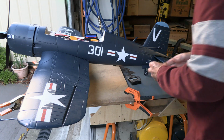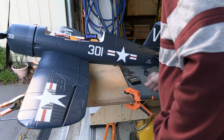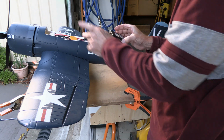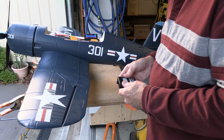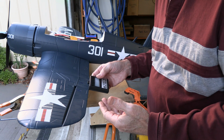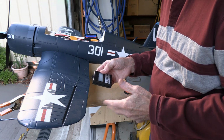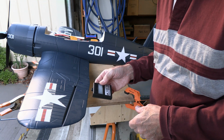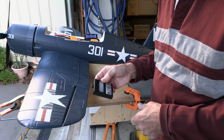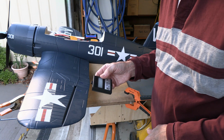Okay. Now I'm going to stick that in my pocket so it doesn't blow away. I've got a tachometer that I'm going to use to measure the RPM. Now note with these, they're measuring pulses of light. So if you got, especially, the fluorescent lights going, it'll actually measure 50 cycles per second or 60 cycles per second, depending on what it is, and interpret that into RPM.